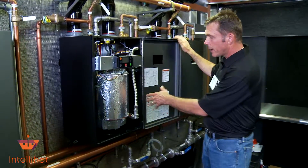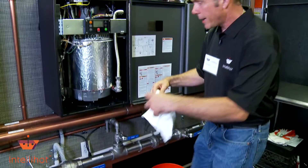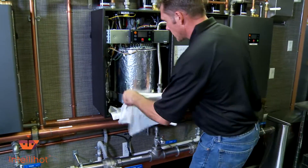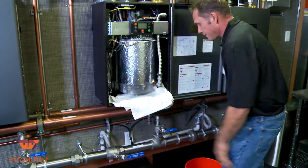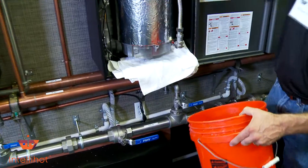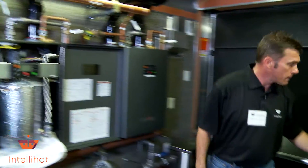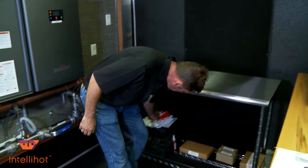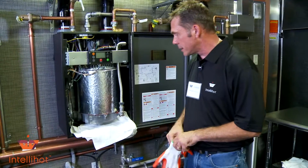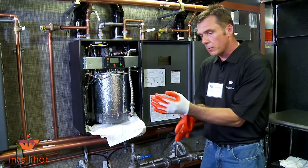I did put a hinge on mine so we can make it look faster for the class. I've got a few little rags here I'm going to lay them down in the bottom just to try to soak up any water so I don't have a mess. Basically I've got a bucket where we can try to catch what water is in here. It's obviously going to stop at our isolation valves, and I want to remind you to wear gloves messing with these ends of these pipes — it is 304 stainless, very sharp, it will cut you.